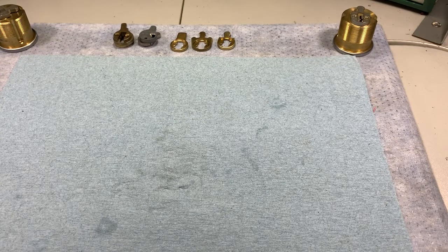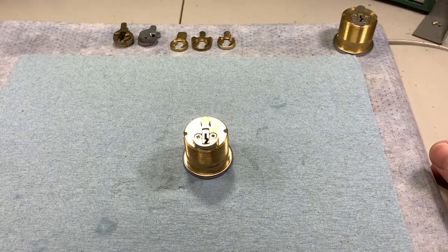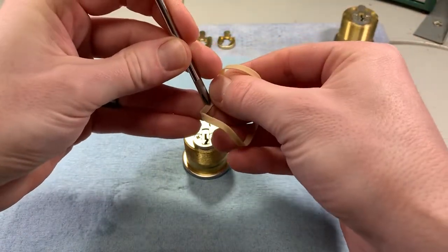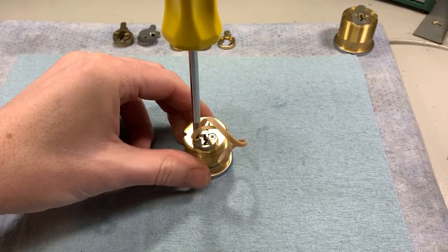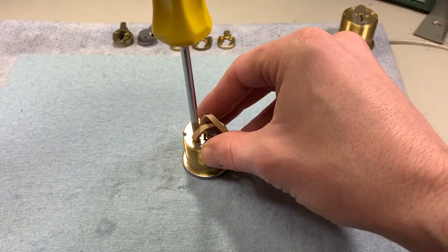The second thing you're likely to encounter is stripped screws. If they're not too bad, you can take a rubber band, place it over the tip of your screwdriver, and then stick your screwdriver in as if you were normally going to unscrew them. Hopefully that little bit of rubber provides the missing material as well as the friction needed to grab onto the screw to remove it.